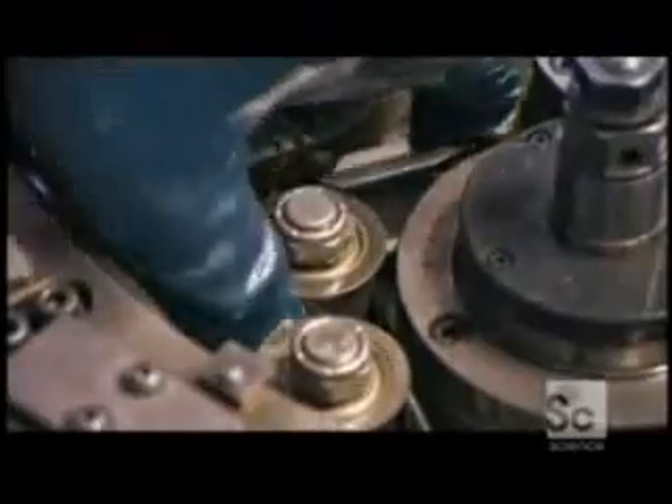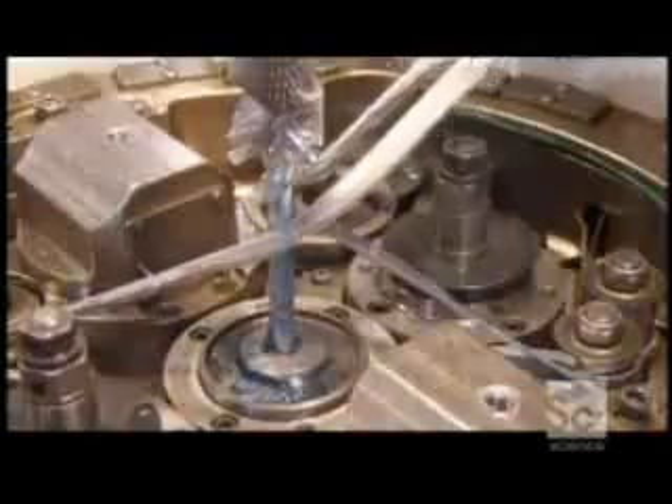To make the coil, workers position an aluminum tube called the spine in the middle of a special winding machine. Then they feed in an aluminum strip. The machine slits the aluminum strip into thin teeth called fins, then folds and wraps thousands upon thousands of fins around the spine, making a material they call spine fin tubing.